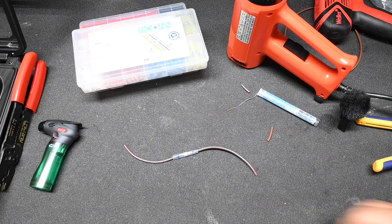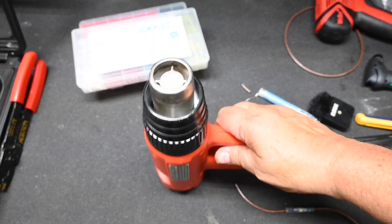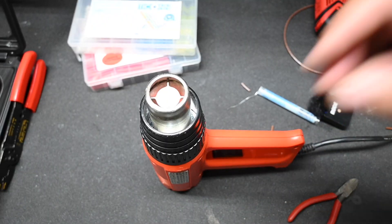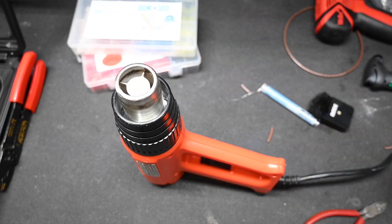Here's where I have the most difficulty with this type of butane, because I've actually burnt a hole through this by applying too much heat — I've not done that with the heat gun. You may have to apply the heat for 30 seconds or so to get the solder to fully melt on these connectors. This has the same issue as the first method in that it does create a bit of a hard spot, so just be aware of that. The cost of this is about two cents per connection, so it's still fairly inexpensive.